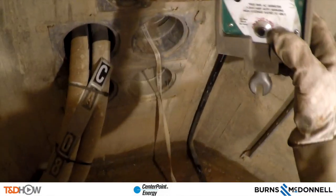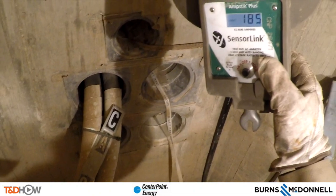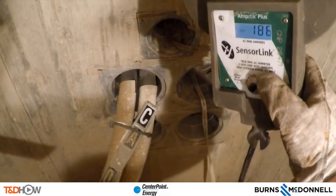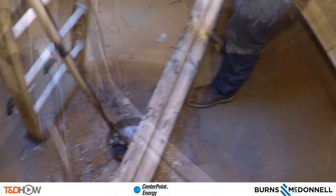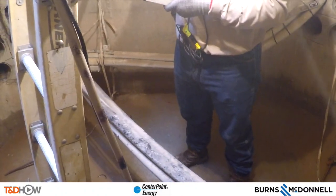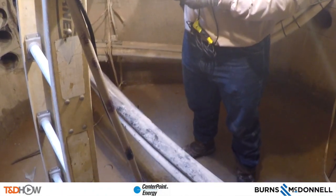Checking amperes — I got 185 amps on this particular one here, so I know it is working properly. I also come over here to amp this to see the process of us getting phased, to make sure that we don't lose our phasing and that we have the correct phase.